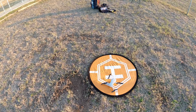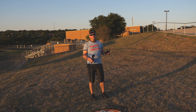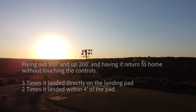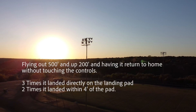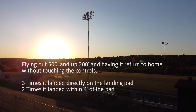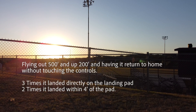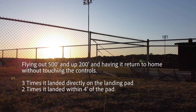So out of five tests, it had three successful landings on the pad, one time three inches off the pad, and one time about four feet off the pad. I'd call that about a 60% success rate for exact return to home. All of that is tolerable — if you're out in the field and lose signal, the return to home switch is going to get it very close to you. But if you want absolute precision, you're going to get it about 60% of the time, today, with very little wind. That was pretty cool.